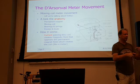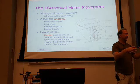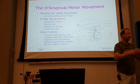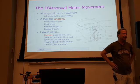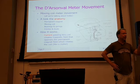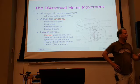It's the same thing, especially with the AGC lines on a 5-tube radio. That's a very, very high impedance line. You've got to measure that carefully, because the meters will drag it off. In the better sets, where you have the pin voltages in a table, you usually find some fine print that tells you what kind of meter they used. That's why 0 volts. Like you said, the meter will make a difference because it becomes part of the circuit, since the load is not insignificant.